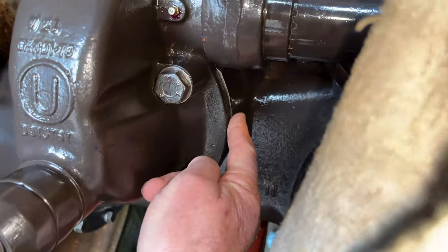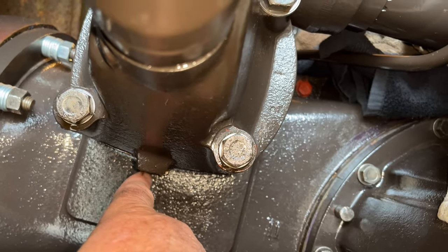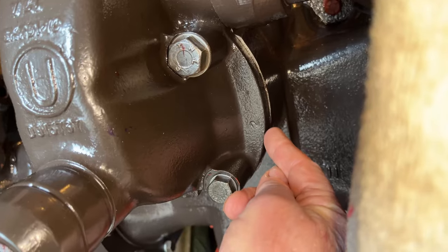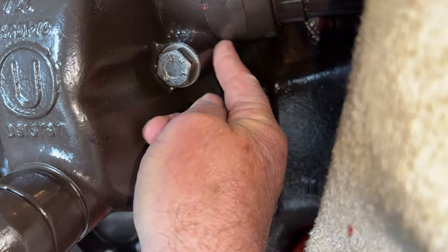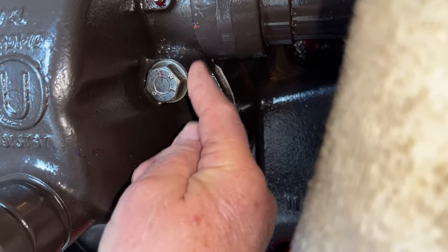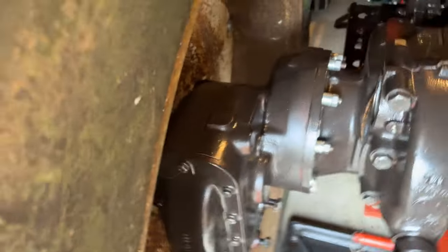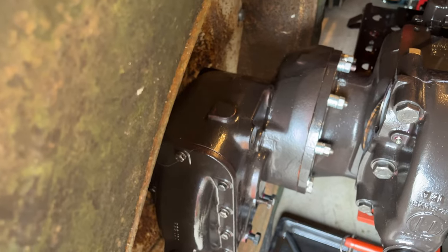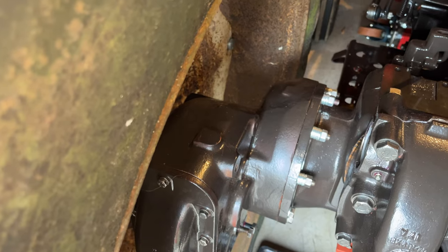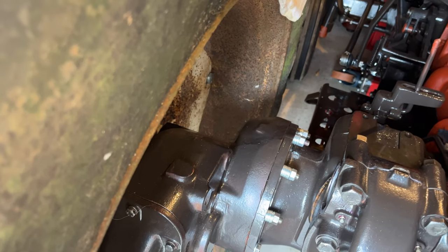Where I think the hydraulic ram cap is leaking — somewhere down this edge — the drip manifests itself here. When I get a bit of tissue and go this way it's dry, but when I come this way up here it's wet, though towards the shaft end it's dry again. So it's around here somewhere. All these are torqued up and there's 515 sealant on here. We'll take it apart again and have a look — we'll tie the rock shaft in with a strap so that when I take the cover off it cannot come backwards and twist and damage any of the internals in the bracket.